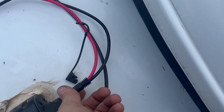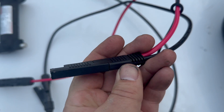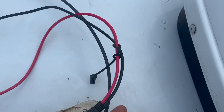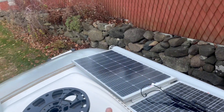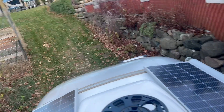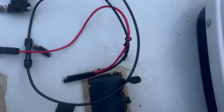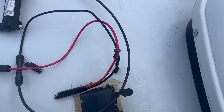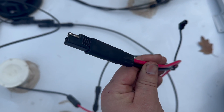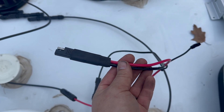I kind of screwed up a little bit — I keep forgetting I've got to put on this little adapter for these because they're backwards. That's one of the other reasons it's good to test your solar in the twilight like this: it's not many amps reversing into the charger, and the Victron chargers don't handle a little bit of reverse current with much of a problem. I just take a piece of heat shrink tube and go over that, and now it's a plug. No one would be the wiser.